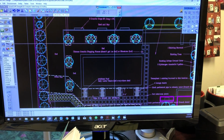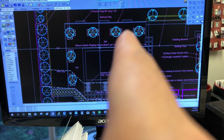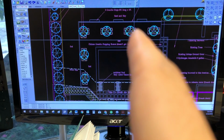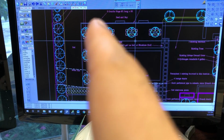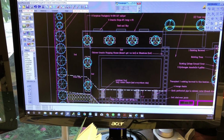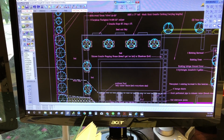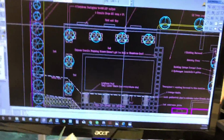Okay, that's the idea. Now the other thing to point out is, because there's a 14-inch difference of grade and you're only sloping it roughly 3.5 inches, you still have 10.5 inches of slope. So my thinking is you still want to access the lawn. Rather than having one long step, a cost saver would be putting in 3 single steps, 6 foot long each. Same thing, granite steps, so they match the color of the granite curbing. The curbing, we would buy it roughly 17 inches tall. We'd bury around 7 inches of it in the cement bed so it doesn't shift or move over time. So I think that's your best move as far as functionality, aesthetic, and also best value as far as cost goes.